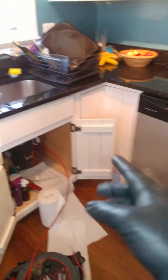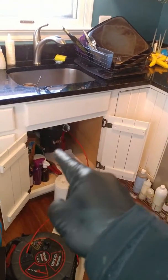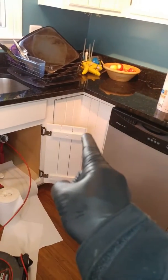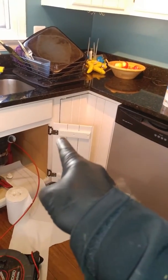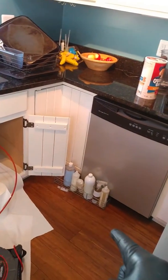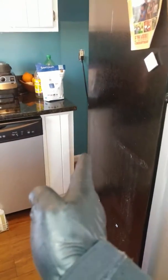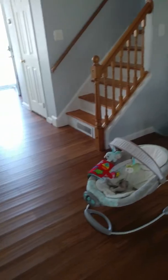What I want to do is take out the garbage disposal, jackhammer down right here with a chipping hammer, and come out. You could probably do it in the lazy susan if you want more room. Come out in front of the dishwasher right here — there's no sense for it to be back there anymore. Bring it over and 45 back to the old line, 45 back this way, then video the rest of it to see how it looks so we can follow it.